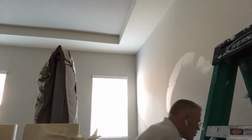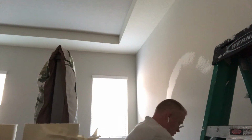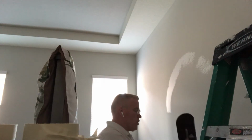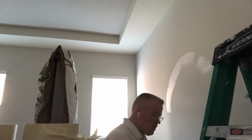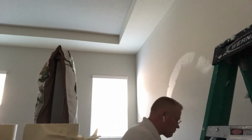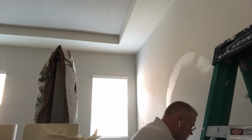Number 1, you want to have a spray bottle with you, a source of moisture with which you can dampen your mixture as you go along. As time passes during the project, the moisture in your ready mix compound or your mud and ready mix mixture will start to evaporate. And this is very taxing on your physical strength. And so adding water softens the material and enables you to spread it more easily.